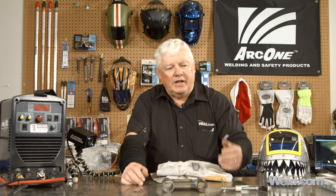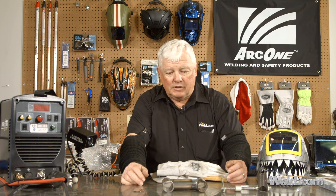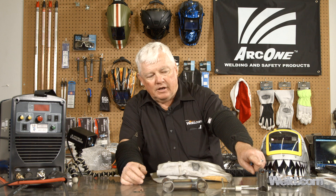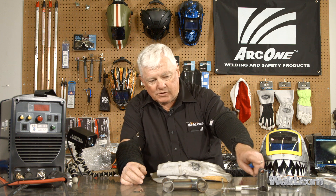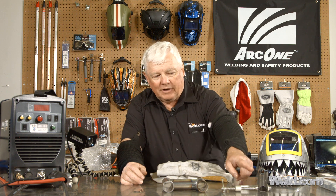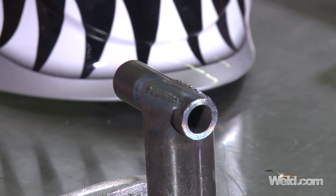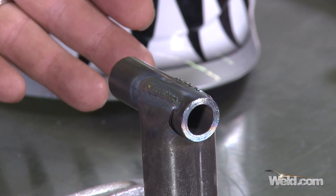Okay, now I'm on DC negative using a 1/16" tungsten, and that's fine for this machine because you're only going to get about 127 amps out of it. We tested it at the high end and we get 127 — not too bad. One amp per thousandth of thickness. I had 125 thousandths wall thickness on the steering arm, and the sheet metal piece was only about 45 thousandths, so I welded this probably in the neighborhood of 70 to 80 amps. Adequate for this.